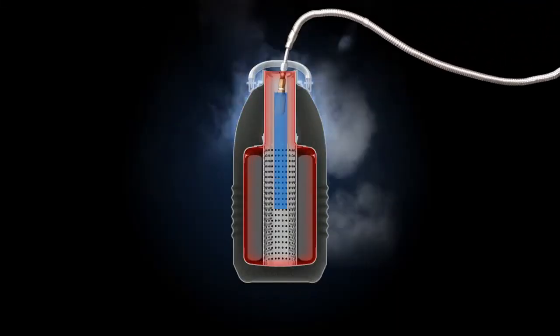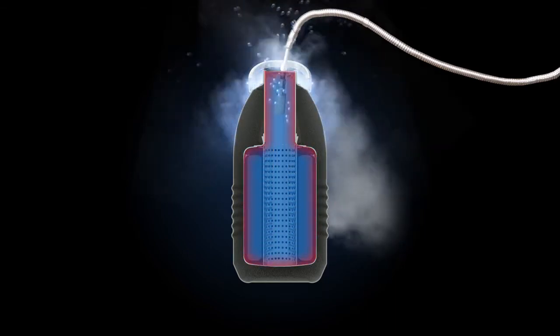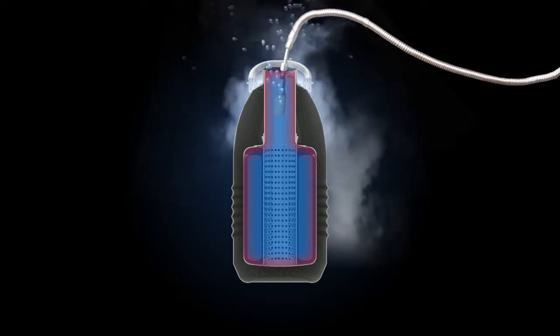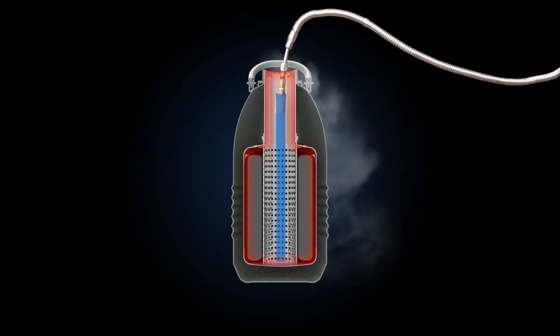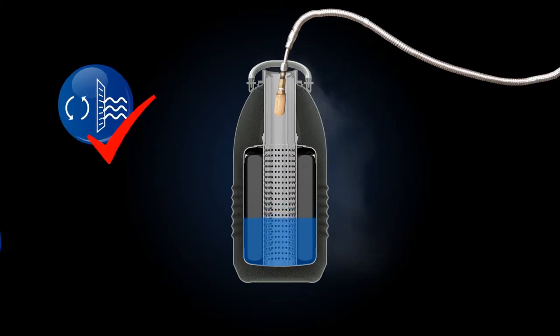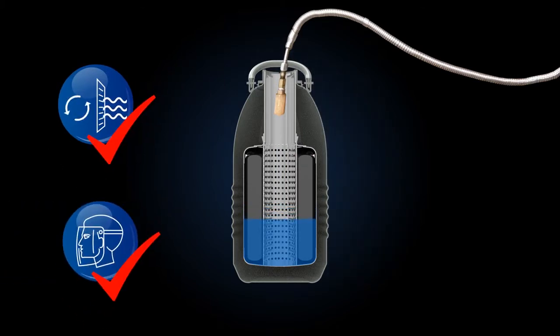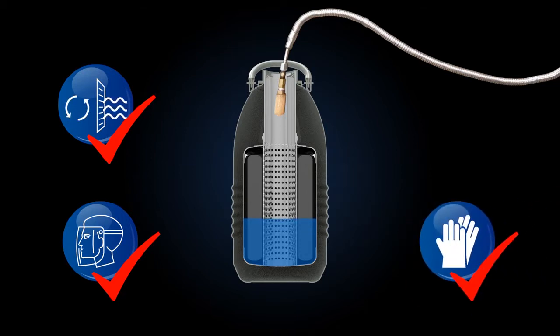Adding liquid nitrogen to a warm container may cause splashing and will generate a large volume of nitrogen gas when a cold liquid contacts warm shipper surfaces. Add liquid slowly to minimize these effects. Be sure there is adequate ventilation. Keep your head clear of the heavy volume of vapor that may be produced, as it is extremely cold and could cause personal injury.